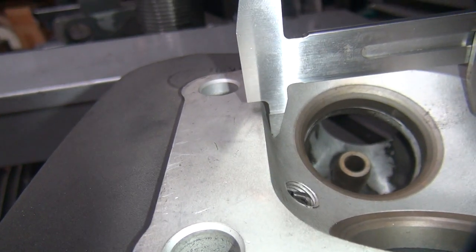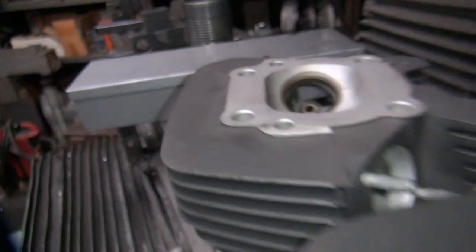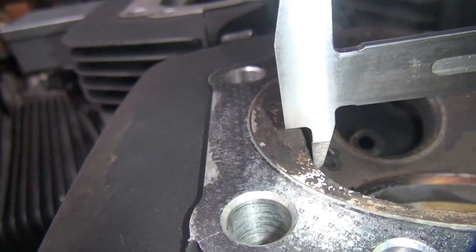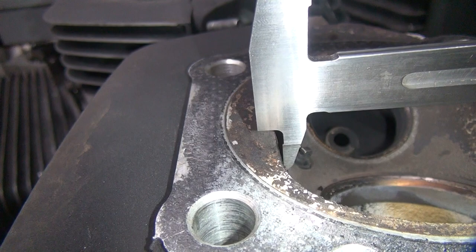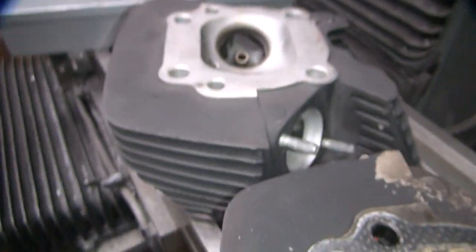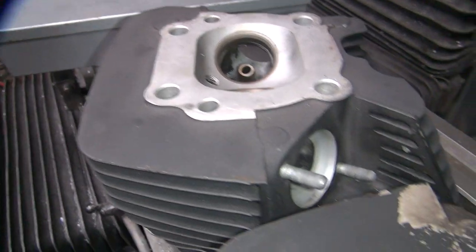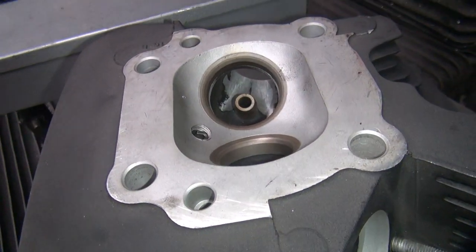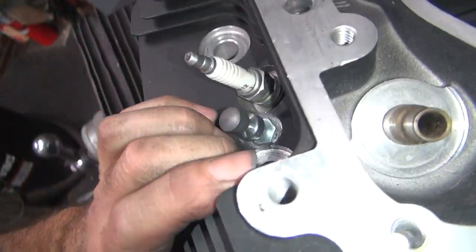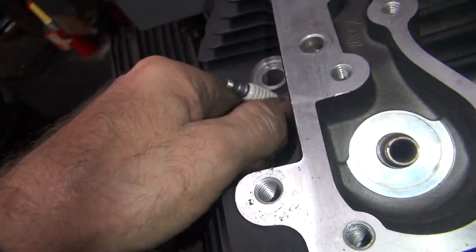See, that's about a 16th of an inch away, maybe 60-70 thou. This one on the same spot is probably about 30-40, about 40 thou probably difference. So we moved over about 20 or 30 thou is all we gained. And I could probably drill it at an angle and gain that much, when they drill that hole in here.